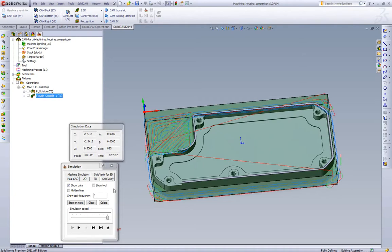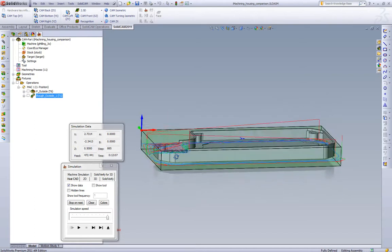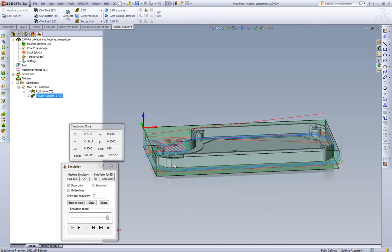So this is a comparison of 13.5 minutes to 12 minutes — not a huge difference, but even using the same feeds and speeds any shop is used to, we're going to see a benefit with iMachining. And as an operator running the toolpath on the machine, you're going to feel much more comfortable not having all those Z clearance retracts and plunging constantly. iMachining also gives you a better feel at the machine because the toolpath stays down and cuts more intelligently.